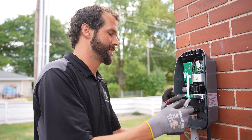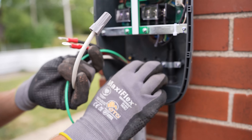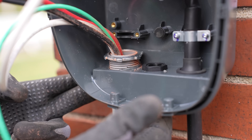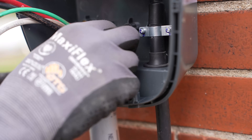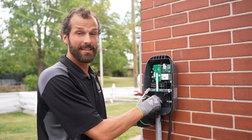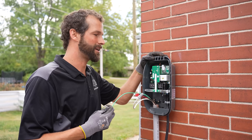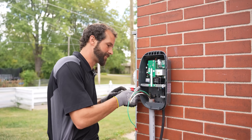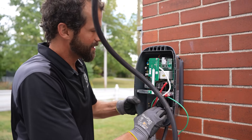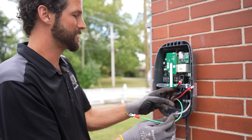Let's get the lock nut on there. It's going to be a pretty tight fit — it's really not designed for one-inch conduit entry. Not only did I have to drill it out, but it won't spin on there; there's not enough physical space. If my fitting hadn't been glued yet, I could have turned the fitting into the lock nut. As it is, you have to modify the lock nut by cutting the nubs off to get it on there. So we're going to go with the recommendation provided by our cameraman and spin the whole unit on, and check the mounting plate to see if we can tighten up and get rid of that rattle while we're at it. Killed two birds with hopefully a single stone. Let's make our terminations, do our testing, and fire it up.